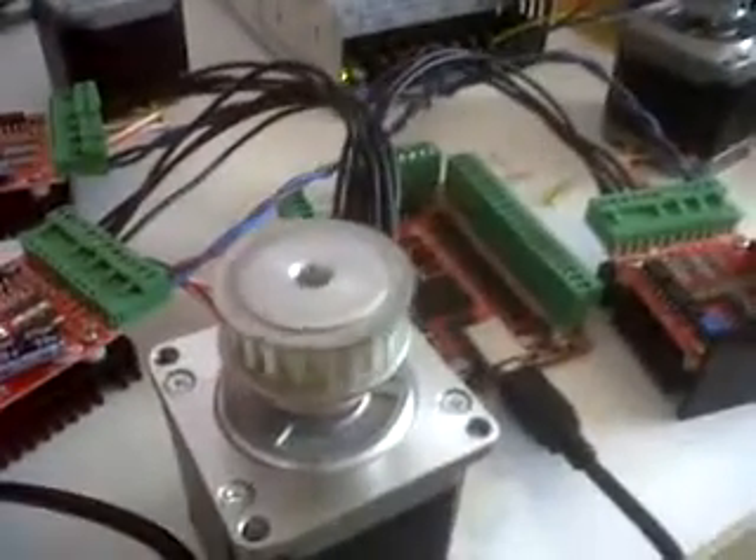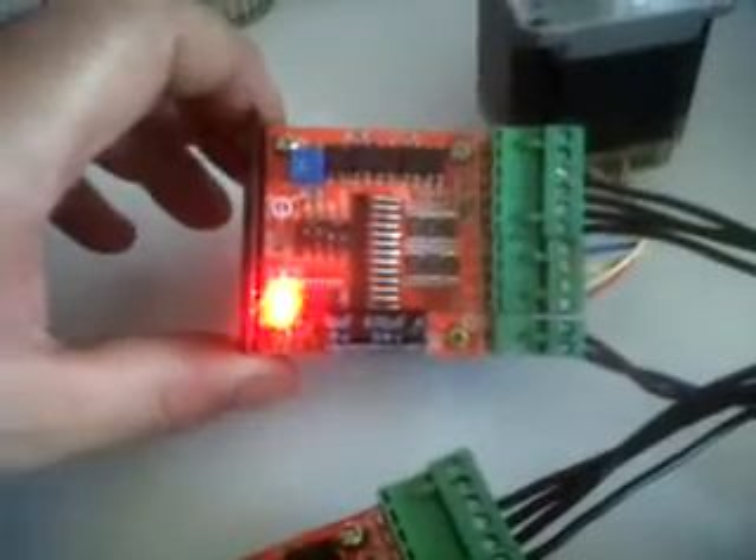If you're a novice you can't really go wrong. You've got a 36 volt power supply rather than a 24 volt. The 36 volt power supply has three lives and three neutrals — just connect it like that. Just remember to have the current all the way down. Whatever you do, don't turn them up to four and a half amps, because you'll just melt the chips. Even though they can take it, everything will just get hot. The motors are nice — they're not cold, the Z is cold, the running ones are just a bit warm. The drivers are warm, so you really need to get some cooling when you put them in a case. Because they're so tiny, maybe you can put a fan straight on the back of them.